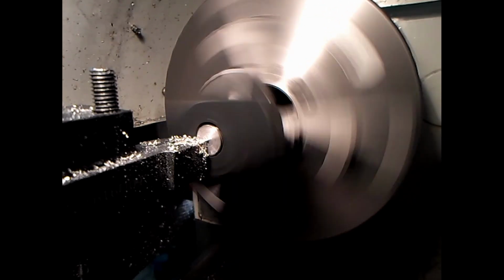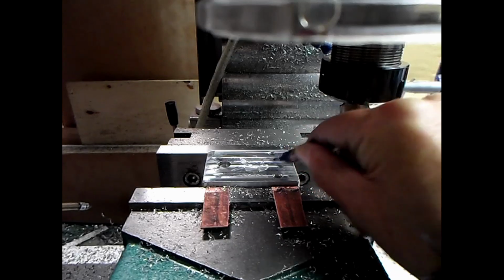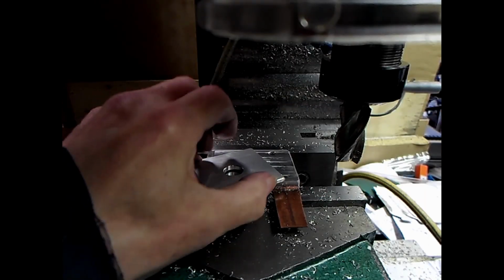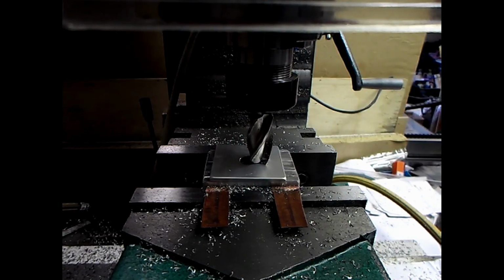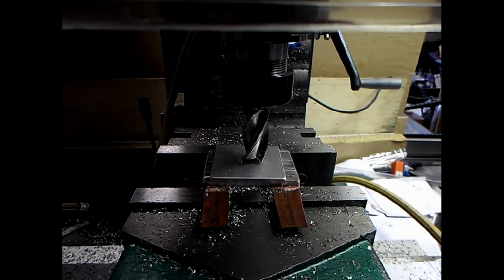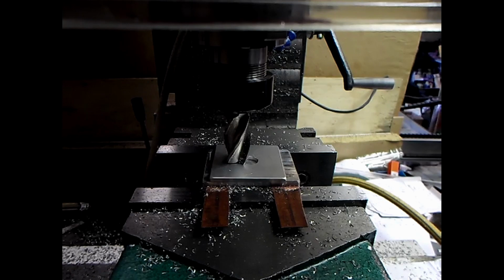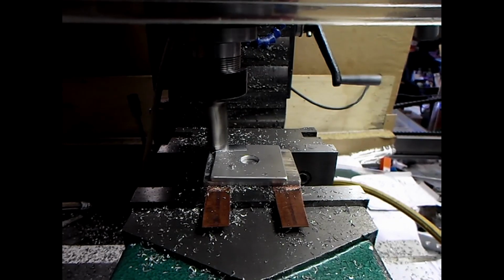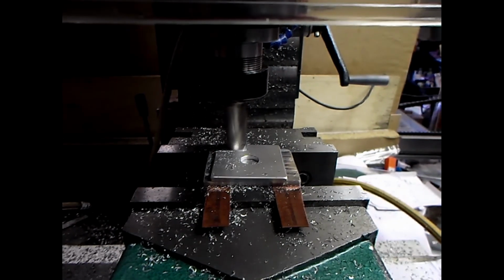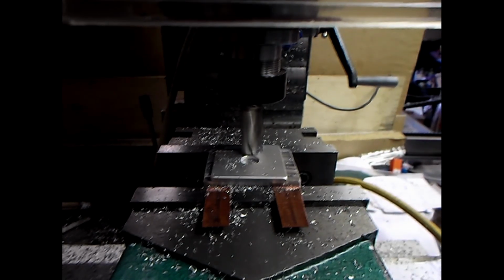I have watched a number of YouTube show and tell videos of people discussing their new tool posts and tool holders. I find it a little unsettling that so many will remove and trash the set screws, a flippant cheap Chinesium, and buy new ones in their local hardware store. These screws may be hard. Maybe the heads could break from being a little brittle, should they be regularly loosened and tightened, having plenty of bite. With a quick change tool post, they tend to be locked down and rarely interfered with after that. With a 4-way tool post regularly swapping out tools, a softer screw may be desirable.